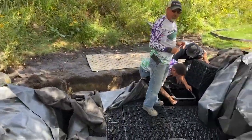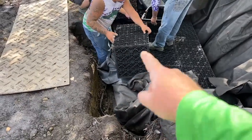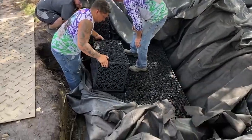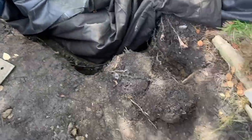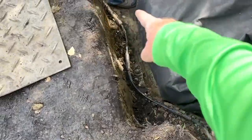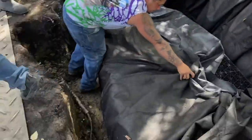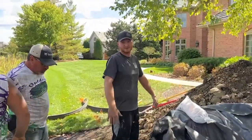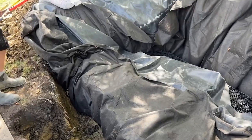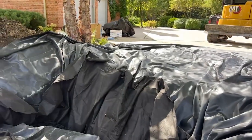The hole has been excavated, Aqua Blocks are in, liner is in, fabric is in. Fabric underneath everything protects the liner from rocky soil conditions, then liner, then another piece of fabric on top to cushion sharp corners of the Aqua Blocks. One thing I tried to hide was this area right here — it turned out to actually be a cable TV line. We cut off cable for about 20 houses for about an hour, which isn't the worst thing. Now we're ready to backfill all four sides and start building a beautiful waterfall.